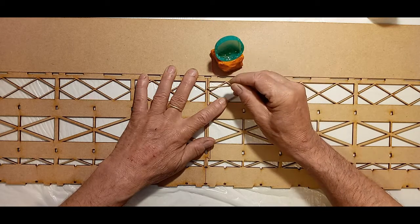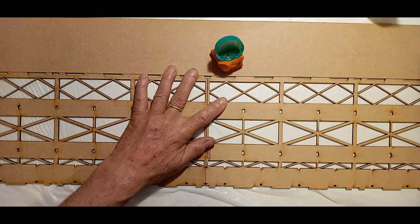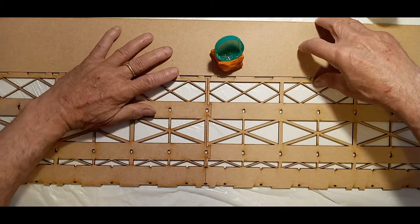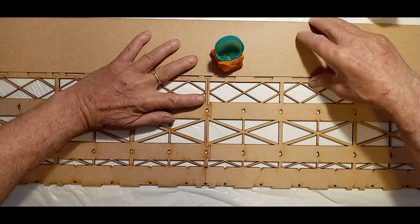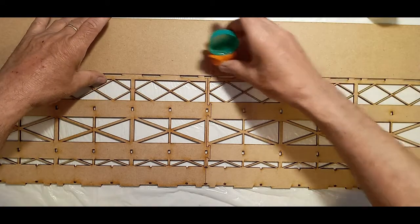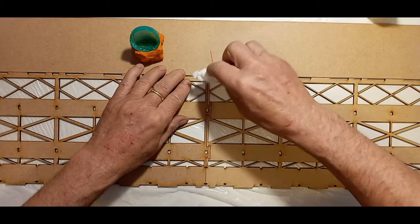It should run down to about a centimetre, maybe 2 centimetres worth. And again, make sure you're pulled against the straight edge and they're pushed together. And hold that for a couple of minutes. And then wipe off the excess glue.